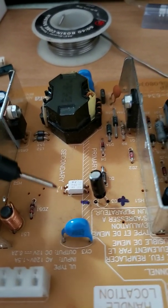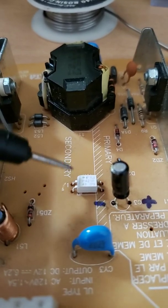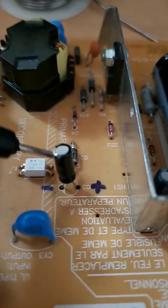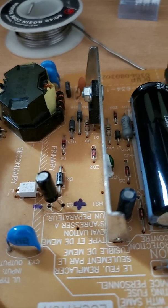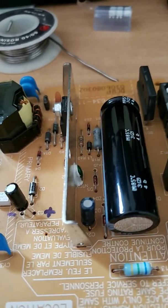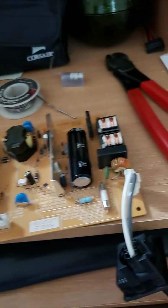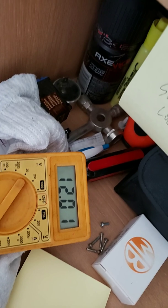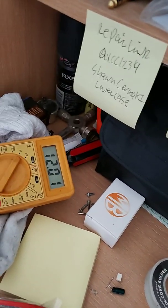It's not a big deal. Cheap Chips sells them on eBay, you can get them. They're not a big deal to solder and unsolder, but I would recommend that you replace this C3 cap as well. I'm going to show you right now that we have 12 volts on this puppy. I'm going to try to turn on the switch here. To test these, you go pin 1, pin 3. I have a test rig set up — go ahead and flip the switch. And you will see that on my voltmeter I have 12.01 volts. I will turn the switch off and you will see that it will go down when you turn the switch off, like it's supposed to.